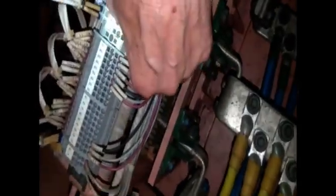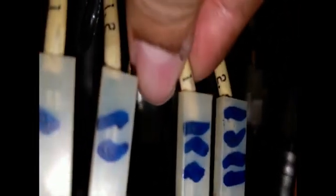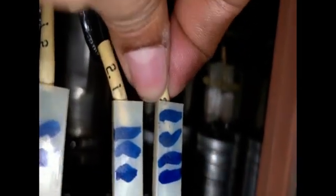All cables are to be checked one by one by hand carefully, and insulation shall be improved at damaged locations. If voltage is hunting on load, please remove the cable ties and check the looseness of all cable lines in electrical equipment on the alternator.